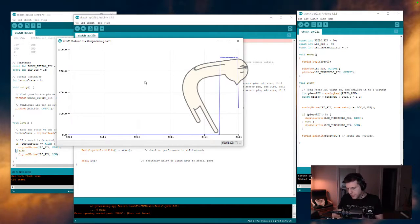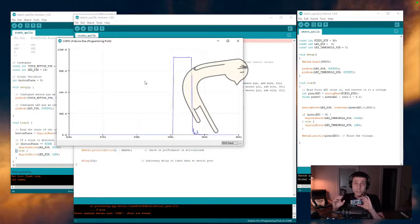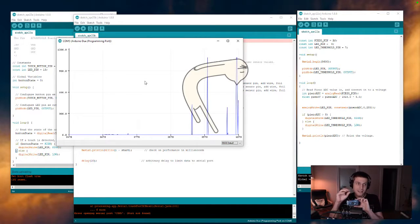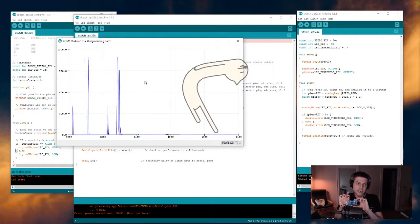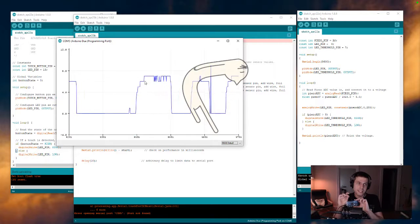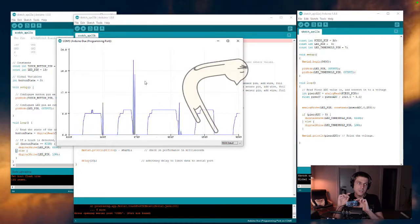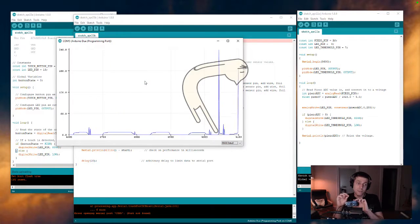I don't know what's going on internally in the library, but externally, I have an input port and an output port, kinda, and I have bridged them with a resistor. And then also on the input port, I have just a dangly wire. And you can look over there and see in the serial prints, whenever I touch the dangly wire, it changes the reading that I'm getting on that input port by an arbitrary value.